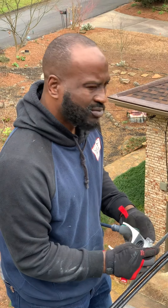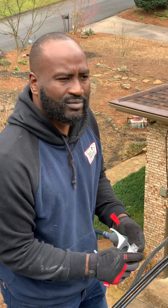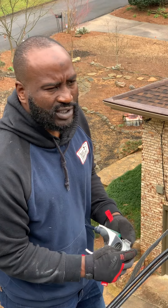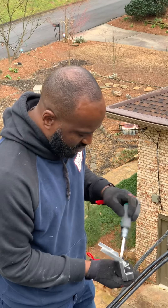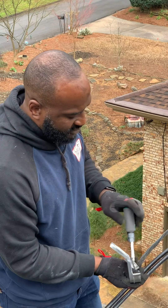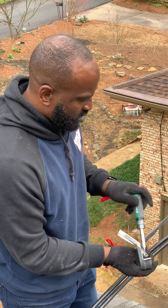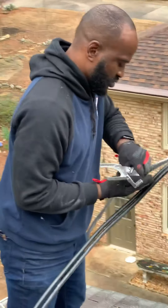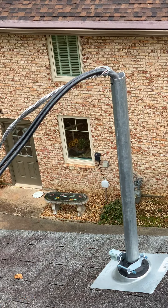This will split the wire. Coming up, you only need three wires going to Georgia Power — they only need two hots and the neutral. Going into the house we had four wires: two hots, a neutral, and the ground. This silver wire is the neutral wire.